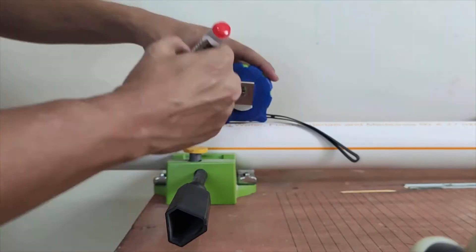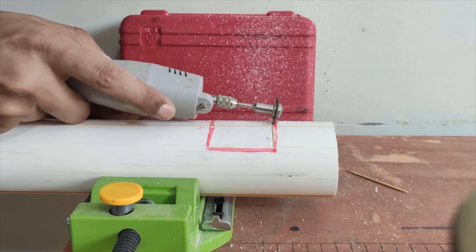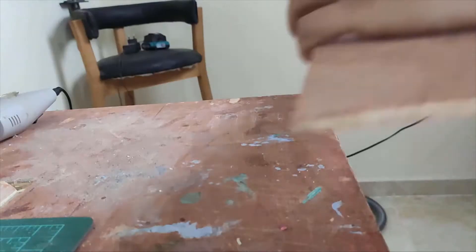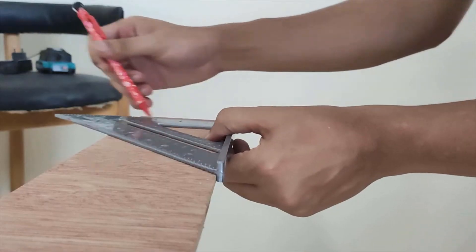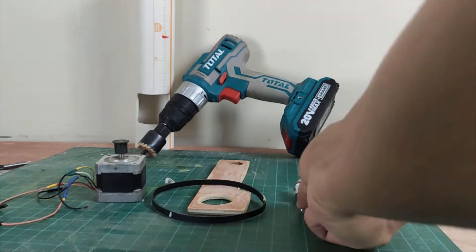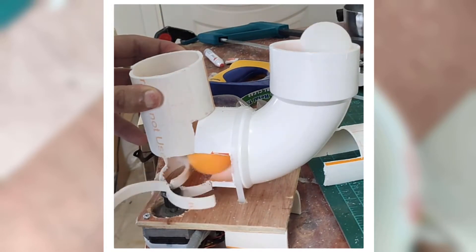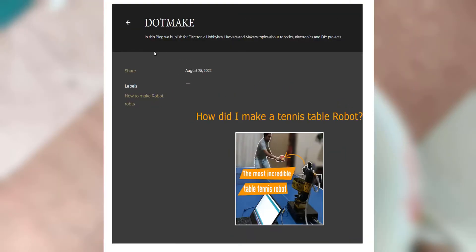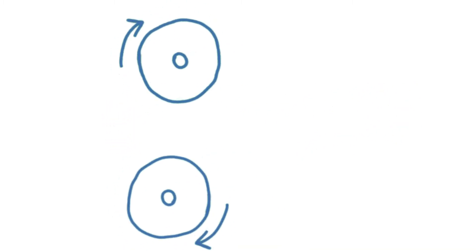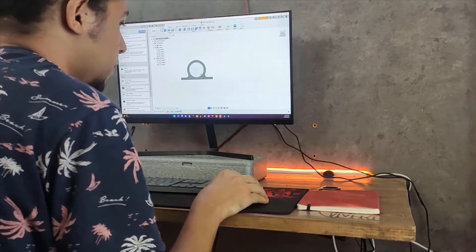The first idea I came up with was to make a lift or elevator, for which I used some PVC pipes, GT2 timing belt, and pulleys. Although the mechanism was working fine, I replaced it with a different one for more reliability. All details of this project design, code, and parts are in the link below. For the mechanism which throws the ball, it simply consists of two pulleys attached to two motors — when the ball moves inside them they push it forward. In the first attempt I used two DC motors and made the body of the mechanism using six millimeter plywood fabricated with laser cutting.